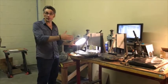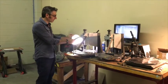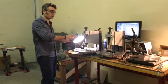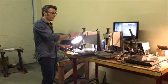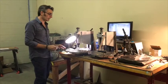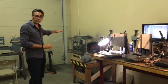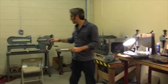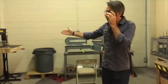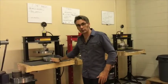You'll see these lights everywhere — you'll see more in the QC room in a second. This helps us get really close-up lighting. There are also magnifying glasses; we're always looking at these parts for any imperfection. This is a centering device. We have multiples for the different plants that have different requirements for the center hole. We center it here, punch a hole in it. Then it goes here and gets back-sanded smooth. Then it goes over here and the outer diameter gets trimmed based on the perfect center. Then over here, we form it based on the plant's specifications, so our stamper will fit their press perfectly.